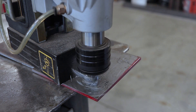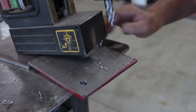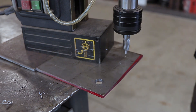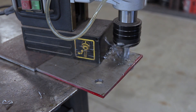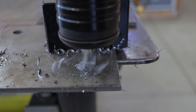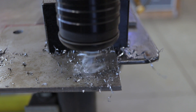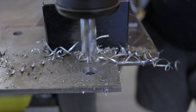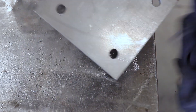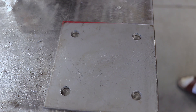The center punch holes aren't strictly necessary — this is just something I like to do. You can see the drill bit itself has a centering pin on it. You can just center that pin over your crosshairs or marks, it locks into place and stays stationary — you never have to worry about it moving. And there it is, simple as that. Four holes, absolutely machined perfectly. The mag drill is amazing.